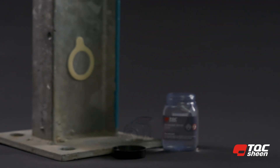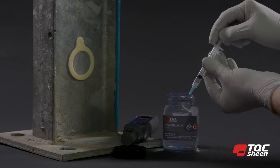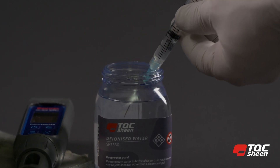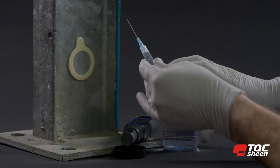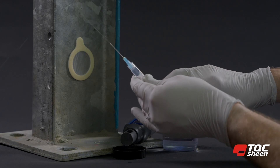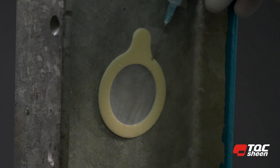Empty the syringe and the digital conductivity meter. Extract the demineralized water from the bottle with the syringe. Fill the syringe completely with demineralized water, then flush to a level of two and a half milliliters, making sure that no air is left in the syringe.